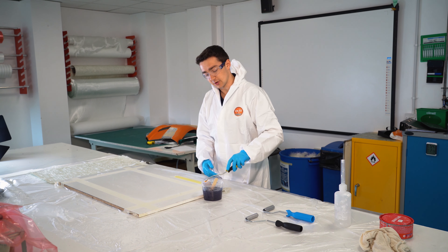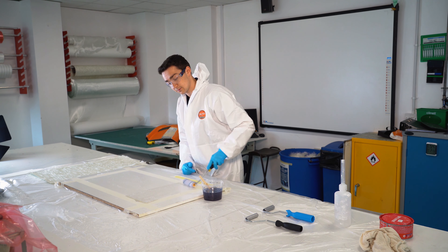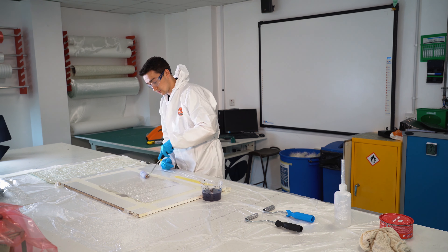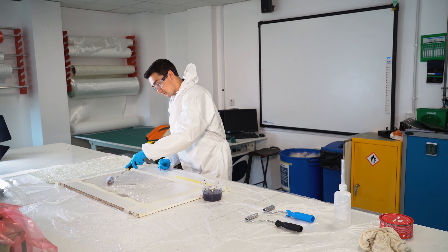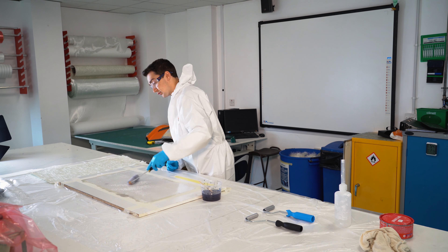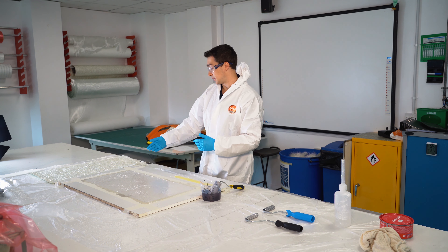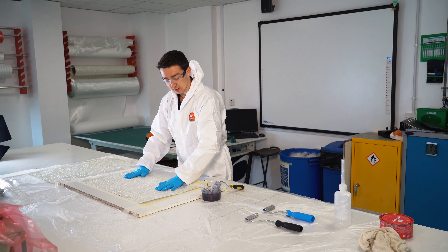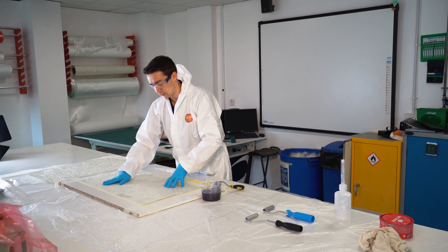The next step is to submerge your roller inside the actual pot. There is no neat technique to doing this — you just want to put it on quite thick. You should have a nice even coverage of resin. Once you have enough resin on the actual board itself, you want to pick up one of your pieces of fiberglass, line it up, and gently just put it down. You can use your gloves to just push it down and make sure it's not going to go anywhere — that resin isn't going to come up through just yet, so it won't go all over your hands for the moment.